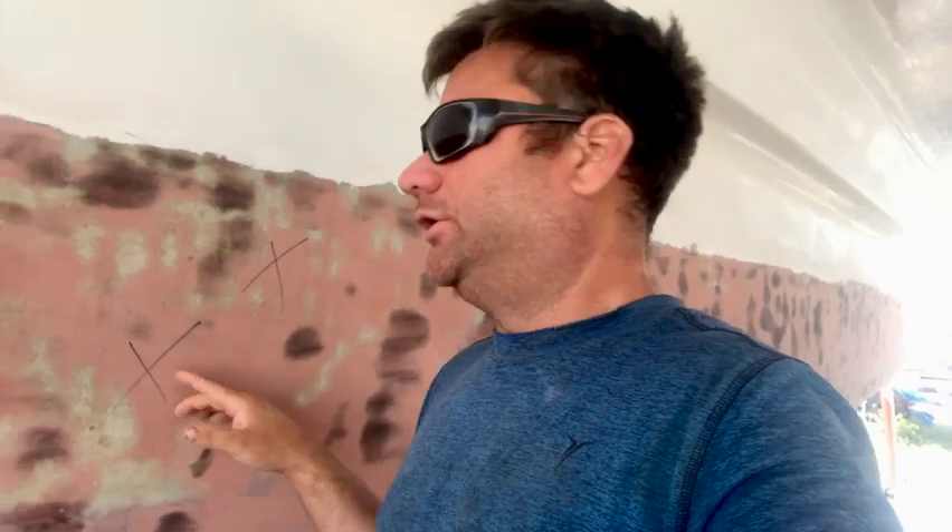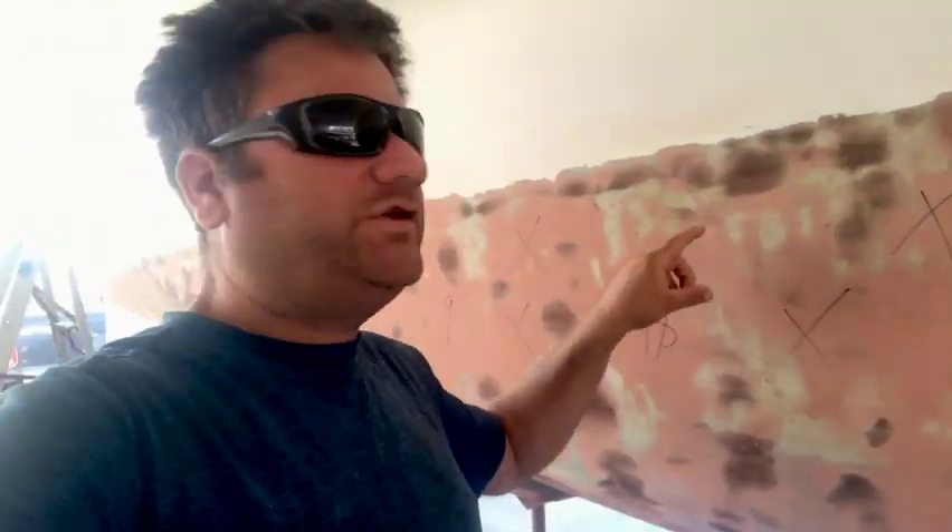To do this, I'm using a hot vac system. Hot vac systems are popular in the UK but hard to find here. I couldn't rent one, so I had a company make me custom silicone heating mats with a vacuum adapter. When you apply heat and vacuum together, the boiling point drops to zero degrees, so I can turn the moisture into gas very quickly inside these holes. I may need to drill some pin holes, but since this is foam I think I can just apply the mat and dry them out. Both sides have high moisture readings.